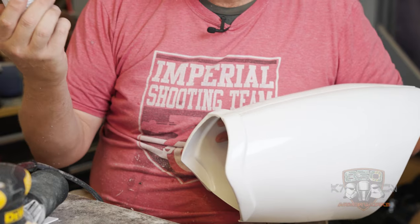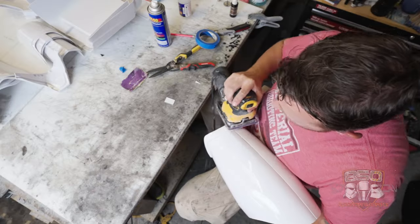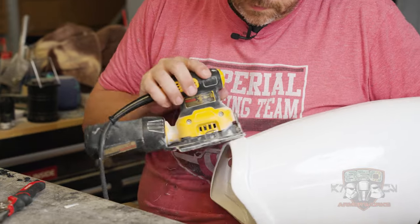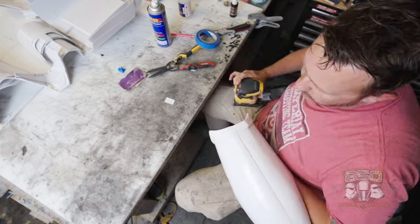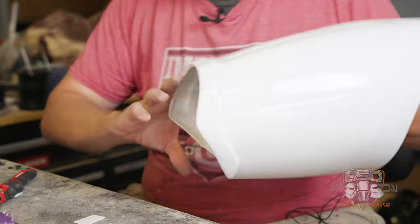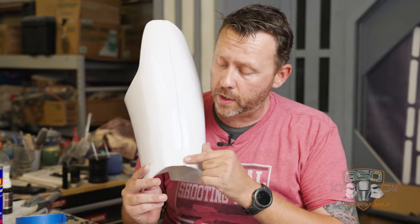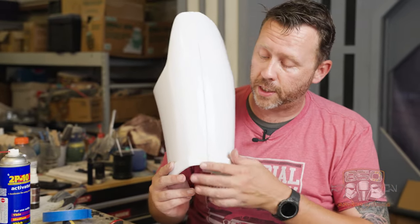Well, that setting will show you. We use thick, excellent gap filling capacity. That's why we use thick. We also use thick so it doesn't run all over the place. It will run, but not absolutely everywhere like thin or water thin. So this is cured again. Now we're fully smooth right here and ready for paint. I've got a little bubble left right here, but since we're going to have a cover strip over it, butting right next to it, I'm not really concerned about that. That's unseen detail. So we are done with the left thigh until it's time for cover strips.